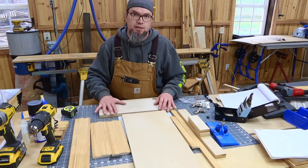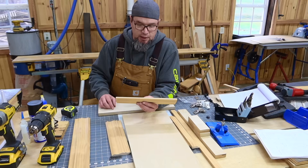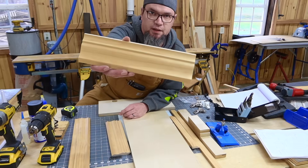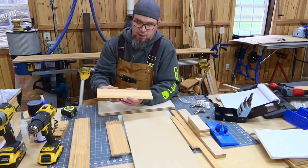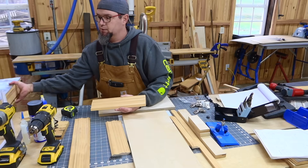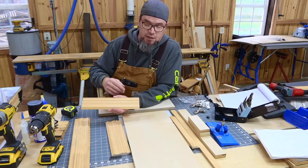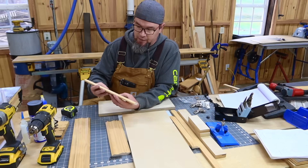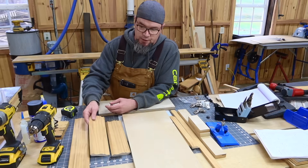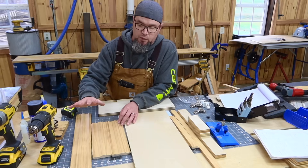What attaches to the bottom is crown molding. The crown I used is nine-sixteenths by three and a quarter — the profile doesn't really matter. I found this inexpensive option versus the really fancy crown at $20 for an eight-foot stick. Back when I was making these it was about five or six bucks a stick. You need two pieces cut at 12 inches and one cut at 24 inches.